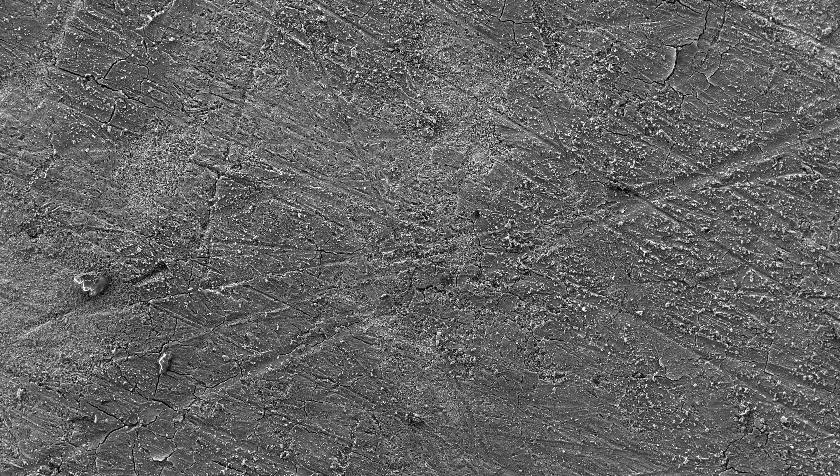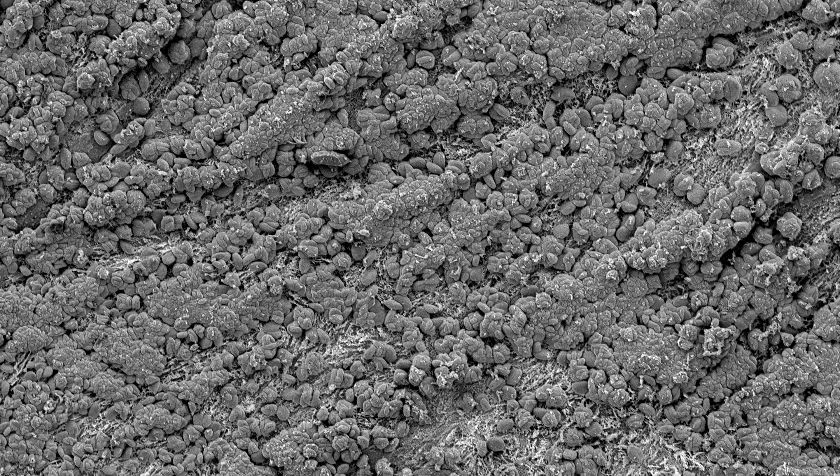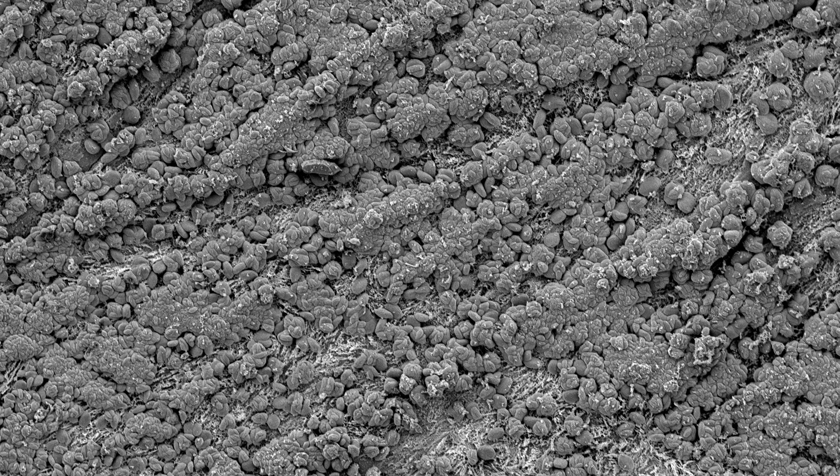This protects the surface through two mechanisms. First, the iron surface is physically covered by that phosphate layer, limiting the amount of free iron that is exposed to corrosive elements. Second, as we can see in these images, the surface is just really rough and porous. When coated with a light oil, it acts like a sponge and retains oil on the surface. This thin film of retained oil prevents water from reaching the iron and stops rusting. The phosphate layer itself is very soft, similar to the hardness of copper, but when combined with the thin oil film, it helps prevent sliding wear against other surfaces too.